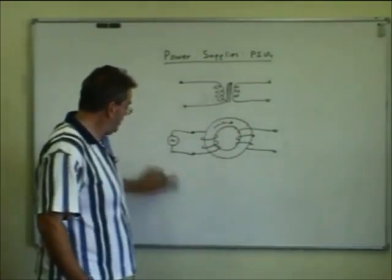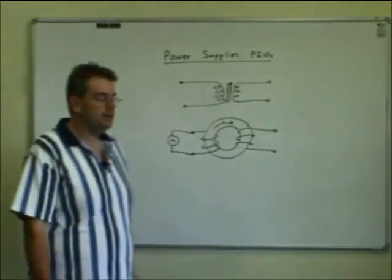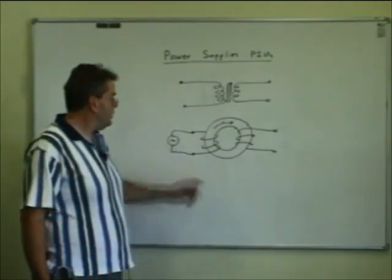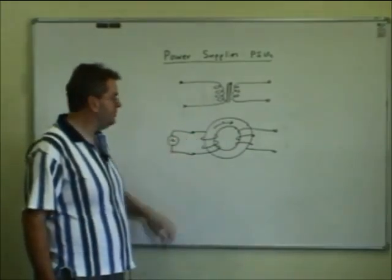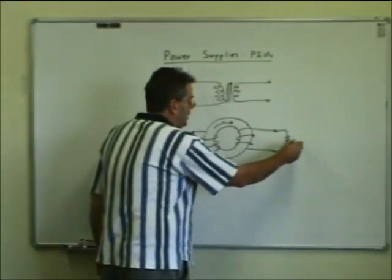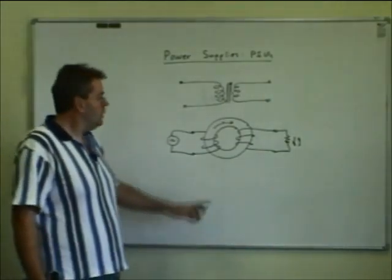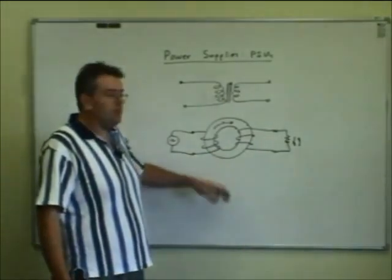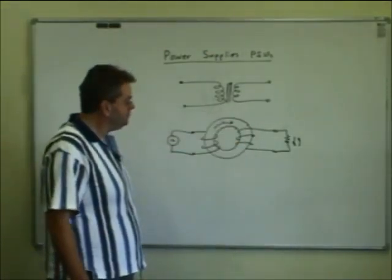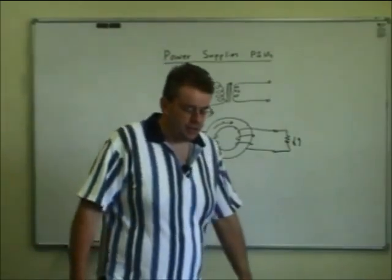The second coil of wire finds itself wrapped around a chunk of iron with a changing magnetic field in it. If you remember back about inductors, if you have a coil of wire with a magnet going in and out, that changing magnetic field will get the electrons moving in that coil. The second coil doesn't care if the changing magnetic field is coming from a moving magnet, as in a generator, or a changing magnetic field created by this winding of wire. So if we connect a load resistor here, an AC current will flow in it — we've created almost a second power supply from the magnetic field coupled around in there. That's the basis of transformer action.